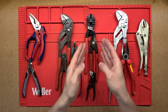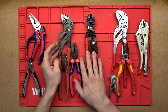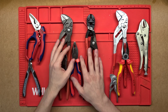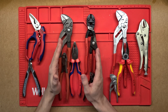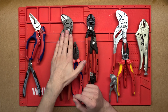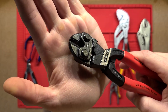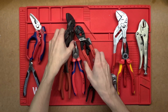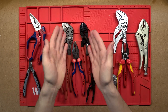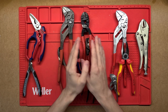The gray has slightly less corrosion protection and the black has slightly more, so heavier-use tools often come in black — though both coatings are available and it really comes down to personal preference on color. This finish is good for average users working in normal environments, even with a bit of moisture. These tools resist rusting and corrosion pretty well, but you do have to look after them — keep them clean and oiled. The oil residue visible on the black ones is just from a little extra oil applied. For everyday use and DIY, this coating is completely fine and it's a bit cheaper than the other finishes.